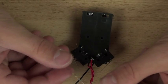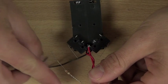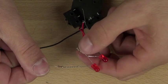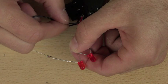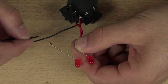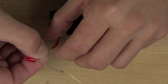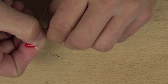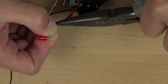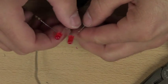Now that we have our LEDs set up, we can begin connecting them to the red wires. But first we're going to test to make sure everything works. We're getting power through the wires — we'll try the other side too, just to make sure we've wired the LEDs correctly. This is a low enough voltage and current circuit that we can use our hands to connect things. Now we're going to wrap the wires from our red wires around the LED positive legs, which are the center legs, twisting everything together. If it's difficult, use needle nose pliers to crimp the connection tightly. The better this connection, the more reliable it will be.